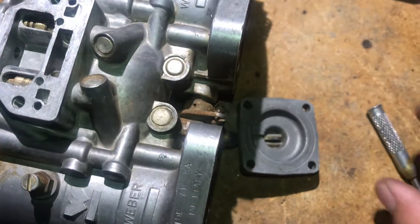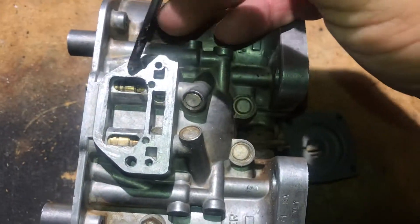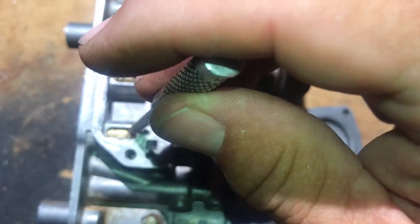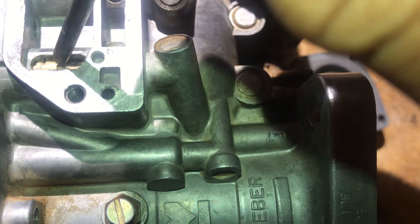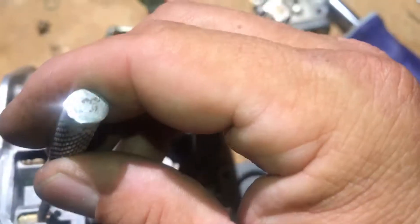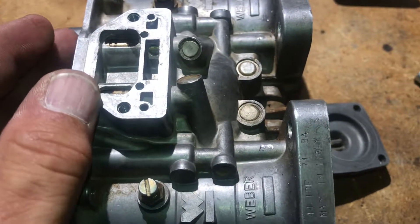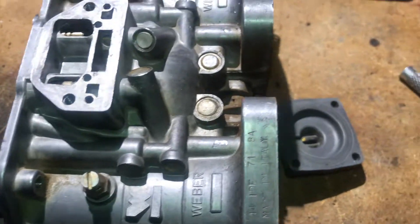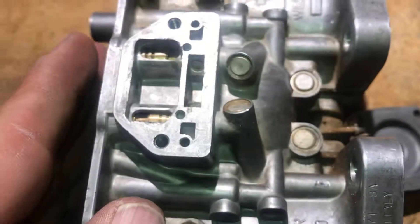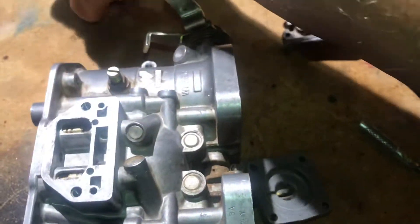If you're going to remove this piston, you're going to want to take a tool, stick it right in that slot there, right in that groove. Don't bend this. Make sure you're in that and then just tap the end upward and it will pop that locking ring off. Now here's the thing, you better have your hand here or a towel or something because that's going to shoot and you're going to lose all of it. So as soon as it pops, just let the pressure off, take the spring and everything out.